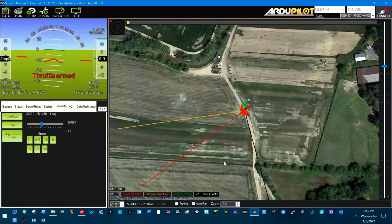Decided to look at this another way. And there's a real big bummer right there. At the instant the platform was armed to get ready to fly, battery was at 12.12 volts. It doesn't matter what it really was, because whatever the flight controller thinks it is is what it's going to use when it fail safes. So, but no, let it sit there for 13 minutes. You see that up here in this telemetry data. This is actual telemetry inside Mission Planner from the flight that was saved to the ground station during the flight.